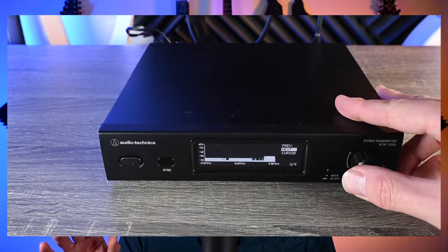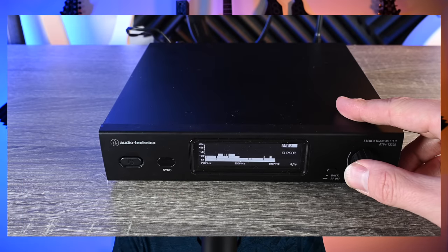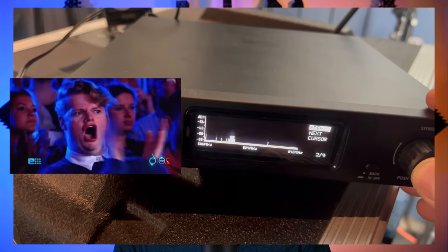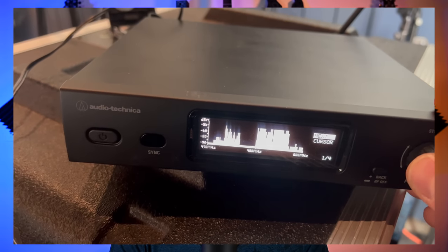It's built well, the design is great, the options are great, it sounds awesome — but there are two main reasons that make me want to switch to this system specifically. First of all, when you do a scan with this, it actually shows you the RF environment, so it almost acts as an RF frequency scanner. I haven't seen that on any other system before without having to use some sort of software. I love this because I can use it to coordinate my other wireless gear and see what frequencies are available. That in itself was already huge.